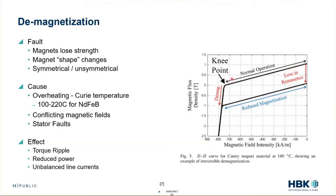That recovery is normal operation — until we hit the knee point. If I apply negative 800 amps in that air gap, I push the magnet beyond the knee point and it can no longer recover. If pushed far enough, it can recover back only to a lower magnetic state. We can actually change magnet strength on the fly, which is useful for things like field weakening, but we can also go too far and turn the rotor into a paperweight.